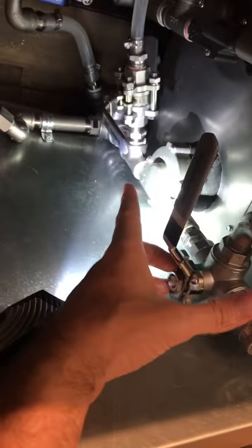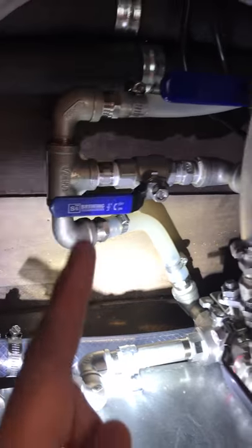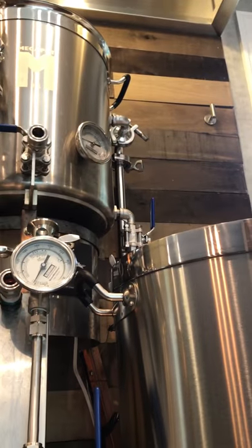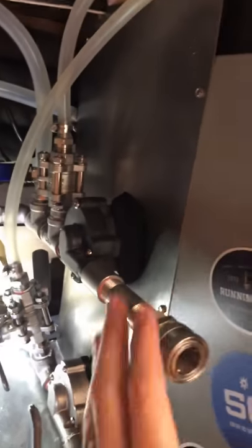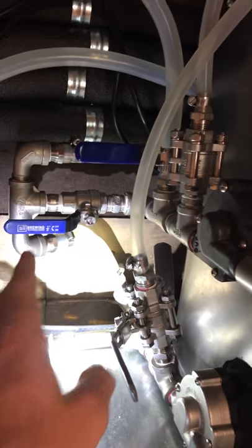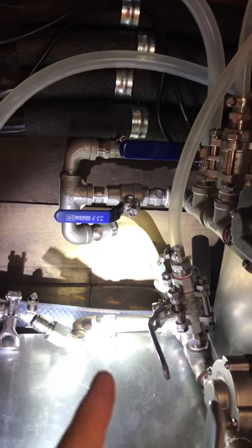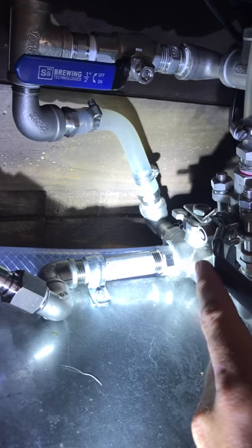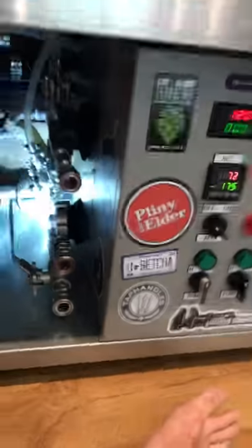With mashing, we're going to come in here, out the pump, bleeder closed, and then I have a three-way in the back. For mashing we send it back up to the Herms coil, which goes all the way up and comes up to that spool at the top of the hot liquor tank. Once we're done mashing and sparging, this is my sparge water pump — this valve gets opened, and I close the return on the hot liquor tank, forcing the water to go through the Herms coil instead of back into the hot liquor tank. These are all L-style three-way valves in the back. I turn the valve and now I can send it to this nozzle, which during brew day connects to my plate chiller down on the floor. There's no reason I couldn't leave it down there, but I like how it looks hanging up on my brew stand.